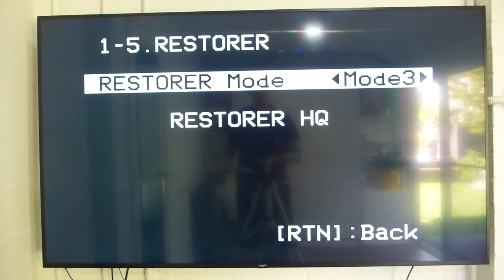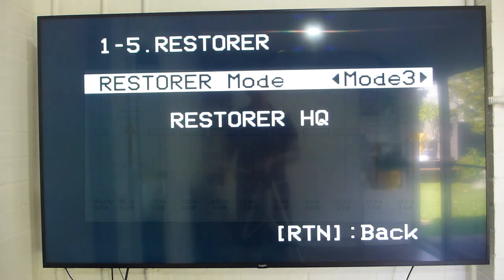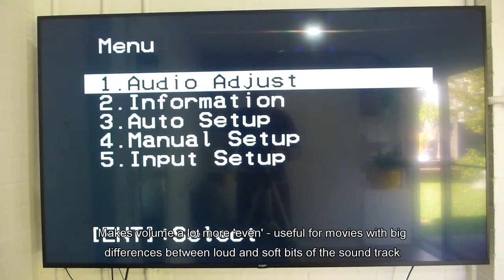Restorer adds a little more punch — like a 10 dB boost at 100 Hz and 10 kHz, which is the classic loud button on car stereos from the 1980s. The amp also has dynamic volume and dynamic EQ, which are internal digital compression controls that allow you to modulate the difference between loud signals and soft signals.